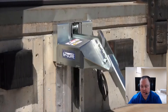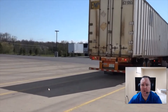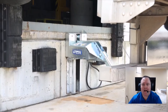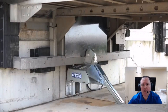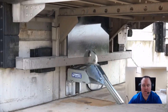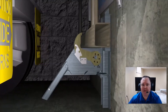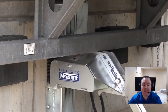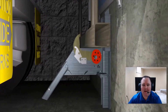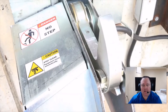The next thing you want to discuss with your distributor is making sure the rotating hook is designed to safely restrain container trailers. Container trailers have a cover plate on the rear impact guard that oftentimes does not allow a normal rotating hook restraint to safely restrain that trailer — the cover plate does not allow the lip on the end of the hook to wrap around the rear impact guard and hold it. If you get one designed for container trailers with cover plates, it will have a secondary locking mechanism. In the case of the unilock, that means secondary locking mechanisms on the hook and welded anchor points inside the housing, ensuring the container trailer cannot separate from the dock before the restraint is released.